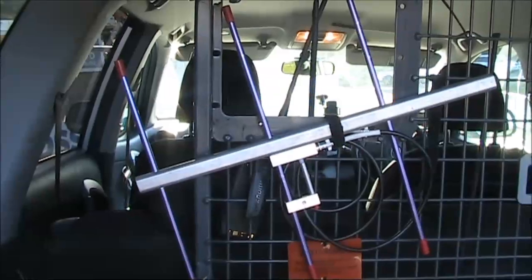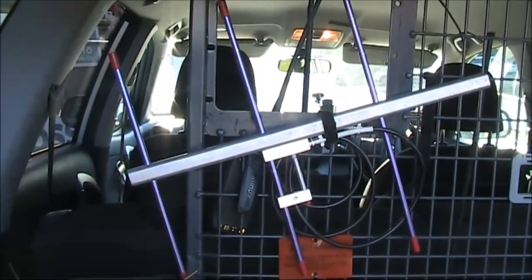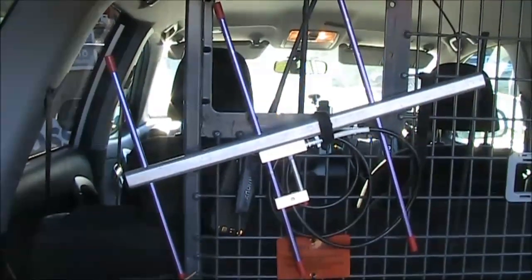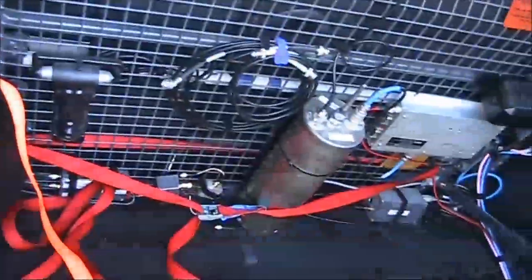Today we have the crossband repeater fly, which has an uplink on 2 meters, but we almost always use 70 centimeters. Yep. Keeps the antennas small. Yes. We've got more than enough spectrum to play with. Yes. None of the payloads transmit more than 50 milliwatts. Okay. That's what we need.